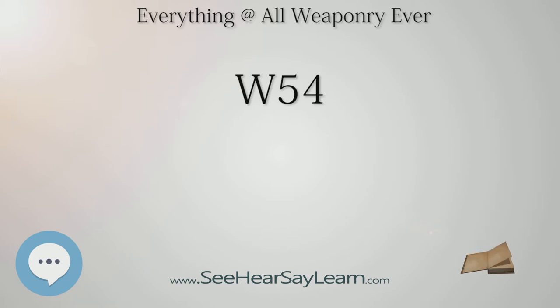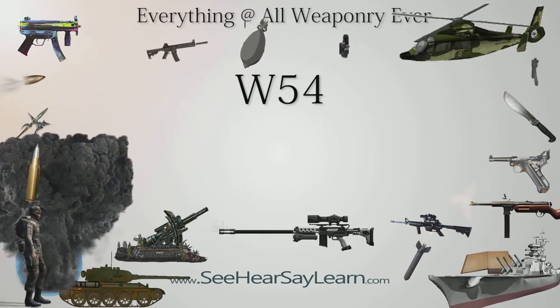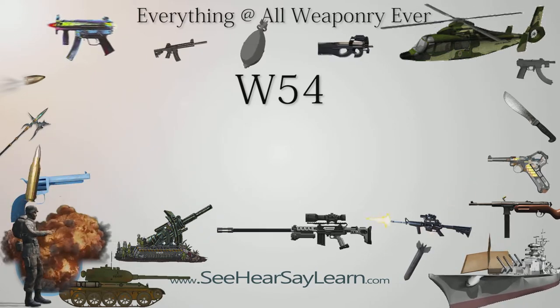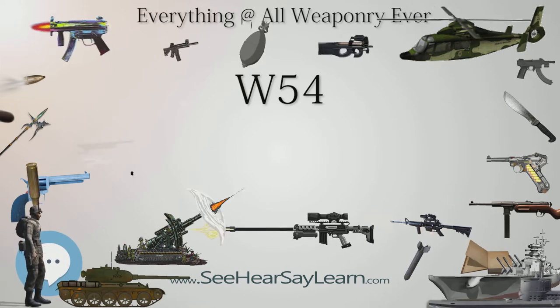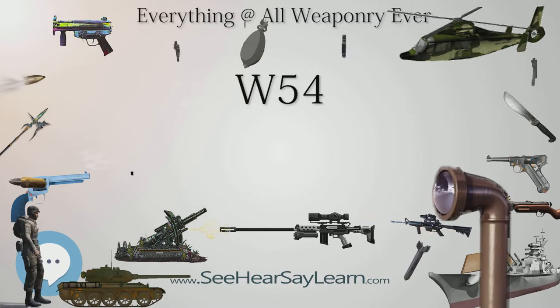The safe arm and electronics module were in the tail cone with a time fuse and a contact fuse in the nose. The best photographic interpolation match to its external dimensions is a center cylindrical section 11 inches in diameter and 5 inches long, with roughly 5.5-inch radius hemispherical nose and conic tail cone. Four fins extend the overall length to 31 inches.